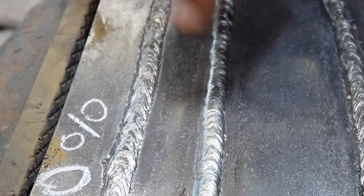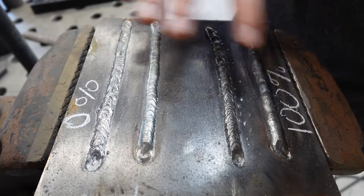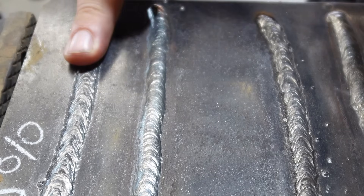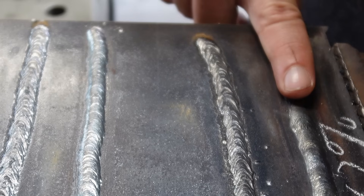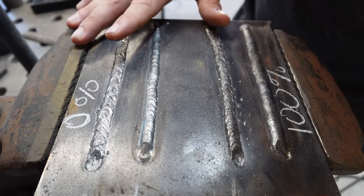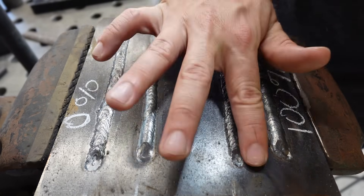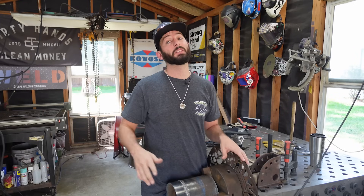It's not something you even need whatsoever — it's just something to adjust depending on the situation or electrode. The biggest difference I see is that the 6010 at 0% was actually wider than at 100%, which is reversed from the 7018, which was wider at 100% and had a skinnier bead at 0% Arc Force. Honestly, 100% just seems a little more volatile, and keeping things basic is where I like to stay. I like to use Arc Force when I'm pipe welding, especially when doing open roots.